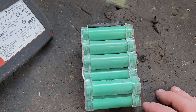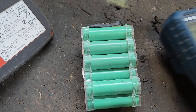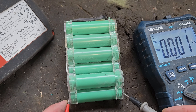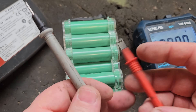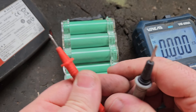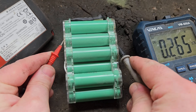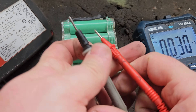So what I'm going to do now is show you how much voltage is in each cell. We've measured the whole pack which is 1.87, which is exceptionally low for a 21.6 pack. Measuring each cell: 0.35 of a volt, 0.27 of a volt, 0.37 of a volt, 0.28 of a volt, 0.26 of a volt, 0.32 of a volt.